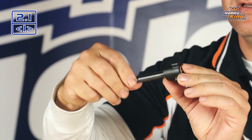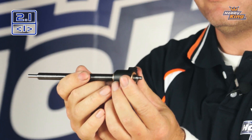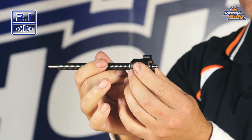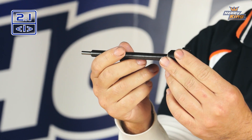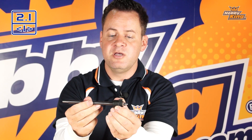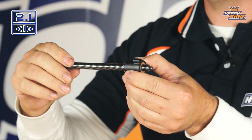Follow that thread all the way through. Right away you should be able to push the collar and feel it pre-loaded, snapping back to the base plate. If there's still play, redo it until the collar is properly pre-loaded. You should be left with just a little bit of brass exposed at the bottom, and when you let go, it gives a hard snap where the collar is pulled tight against the base plate. You'll feel a slight drag from the spring holding the two nuts against each other, but it should feel extremely smooth with no binding. That is an anti-backlash rolled Z-axis lead screw.